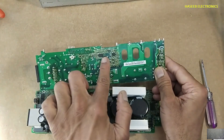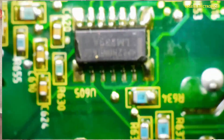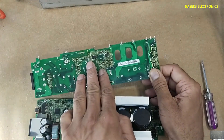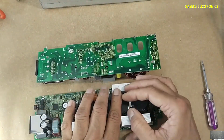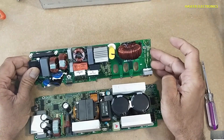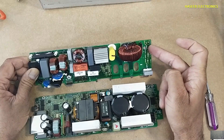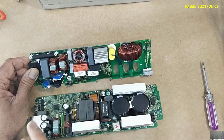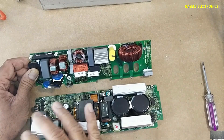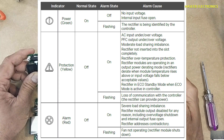The weak signal from the shunt resistors is amplified through these operational amplifiers. On the rear side of the PCB there is an LM239 voltage comparator, which monitors input under-voltage and over-voltage. If there is under-voltage, the power supply turns off its output section. There are three LEDs: green, yellow/orange, and red. The green LED turns on when the power supply is working correctly and output is available. The yellow/orange LED turns on when the voltage is below the limit or over/under range.